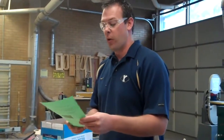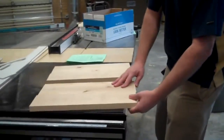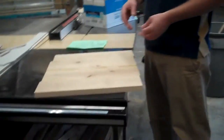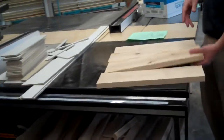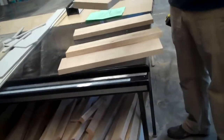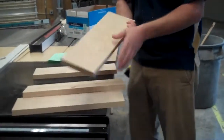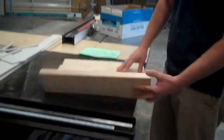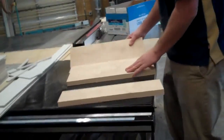Part number six: place your boards together and figure out how your boards will best look. The order is important when gluing boards together, so play around with different options — what if this board's over here, or what if this one's over here? Figure out what looks the best. Looks matter in woodworking. Flip them over and see which faces you like best. This one has a little knot — maybe I don't like that. This one's nice and clean, I like that face. Figure out what looks the best and arrange these however you like them.